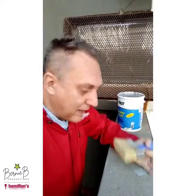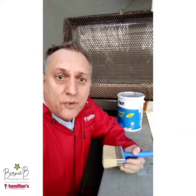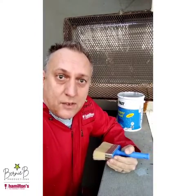Okay, we've got our parapet wall. It has been painted, so we can just rubberize directly on top of the paint. If it wasn't painted, we'd have to put a plaster primer on, and then overnight we're ready to rubberize.